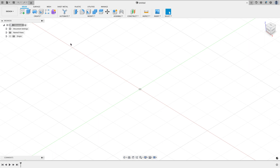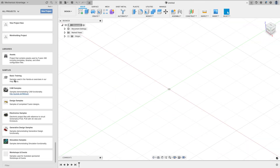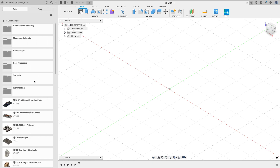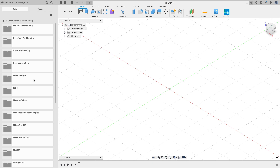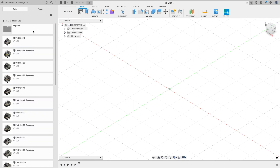If you don't want to follow along but you still want a Lang self-centering vise, you can go to the data panel, go to all your projects, find the samples directory, and then CAM samples. Go to the workholding folder and in workholding you'll see a folder named Lang. The style of vise I'm going to use today is the macro grip series, and in here you'll see imperial and metric versions of all their models. I'm going to set these up the exact same way the models are set up in the workholding directory.